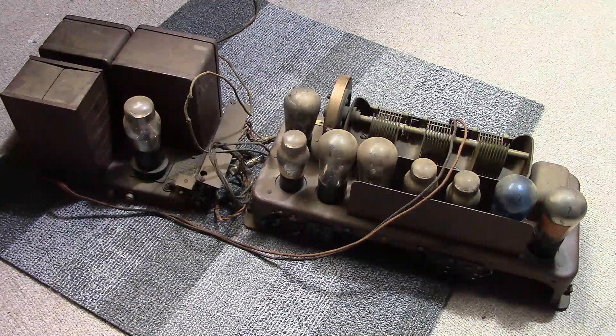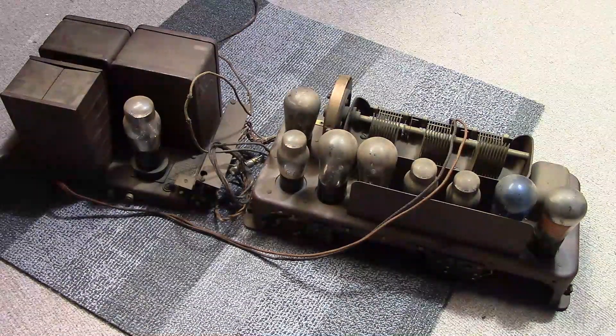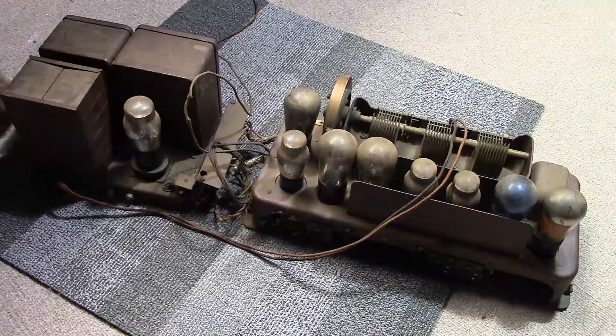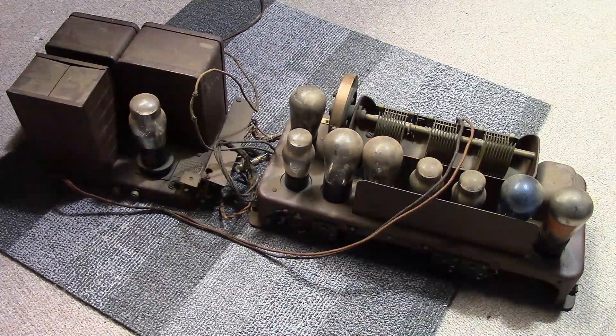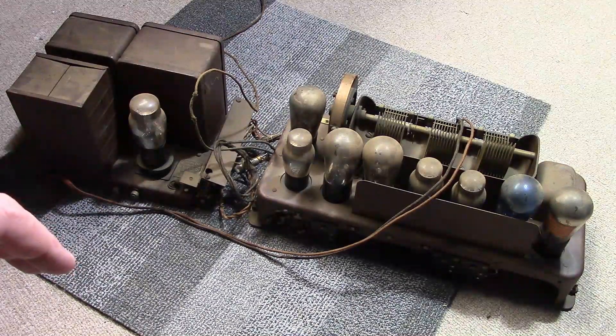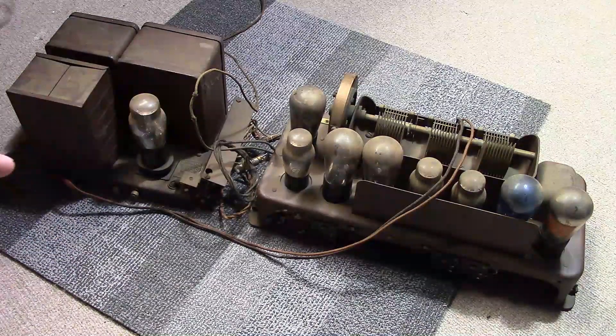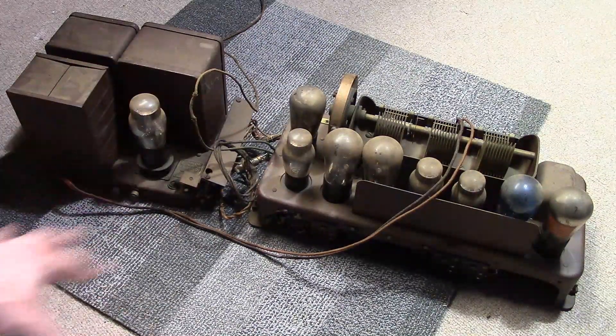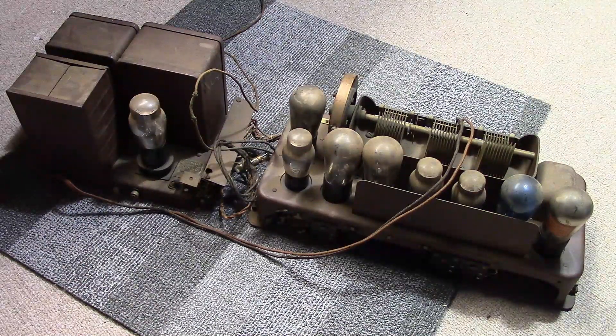So I put it on the back burner. Some of you were encouraging me to just dive into it and start rewiring it, stripping the rust, and tearing it all apart. I could have, but experience has taught me how much work that would be. I did a similar teardown and rebuild for a Brunswick 5KR a few years back and it took weeks — I used acid, the pitting was so bad it went right through the metal in some areas, I filled it with Bondo, primed it, repainted it. I'd rather not do that again if I don't have to.